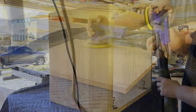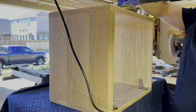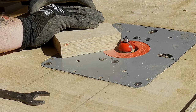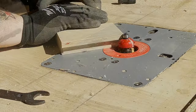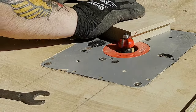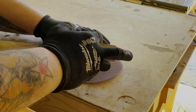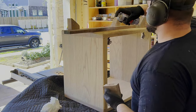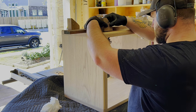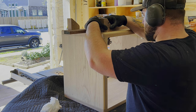With that I took the door off, got everything finish-sanded up to 180 with a soft pad to get on all of those round-overs and keep them nice and clean. Then I needed a handle — I did not want a metal handle from Home Depot. I wanted one out of white oak, and the idea I came up with was just using a cove bit to make this little handle. I'm not going to overcomplicate the attachment process — I just used CA glue and got it about as centered as I possibly could. Same technique with the legs — not trying to overcomplicate it. I don't anticipate this cabinet getting thrashed around or dragged, so the legs attached with CA glue will work just fine.